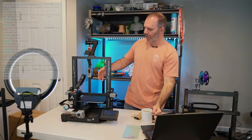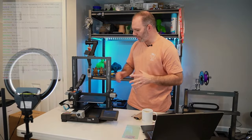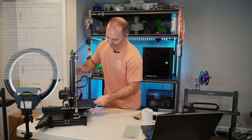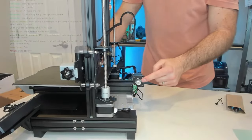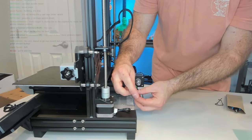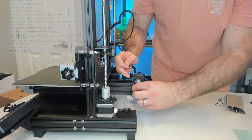It's together. We just did our first auto bed leveling. Let's see. Printer halted. All right, this homing on the Y is not working. We're going to go back to my other fix, which is when I put it in improperly, it actually managed to home better. So this is the correct way. Jack was right. He did his due diligence to make sure that I put it in right, but the correct way ain't cutting it. It's not activating on the Y end stop properly. The wheel is just hitting too low on the end stop and it's not triggering.